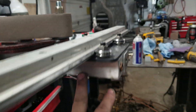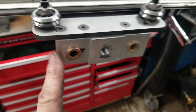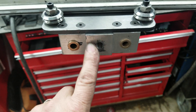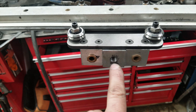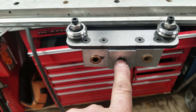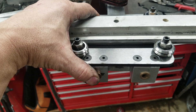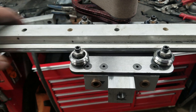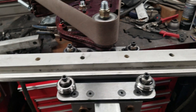I've fabricated up the slide — it's basically just inch-and-a-half square aluminum bar the entire length. That was really fun on the lathe. I got introduced to my four-jaw chuck, especially for this long piece — about 24 inches long — that I had to chuck up in the lathe and bore it longitudinally, then tap it for half-inch 20 threads. That's what makes the slide go in and out to control your depth of cut on each pass.